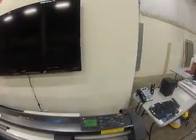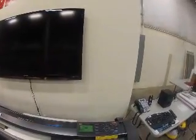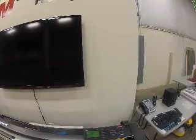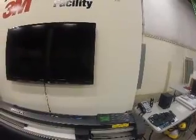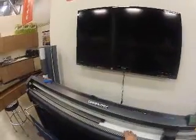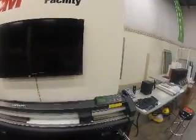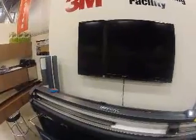I've already got my speed and force set up, but I'm going to run through it so you know how to change and set up your conditions. For speed right now, for 3M Scotchgard, I've got it set on 30, which is fairly fast. I recommend if you're running Venture Shield, you want to be at a speed of around 20, maybe even 15. The reason is 3M actually has a paper carrier that tracks very well because the grit rollers dig into it. With Venture Shield, it has a synthetic liner, which the grit rollers don't dig into as hard — so if you're running it at higher speed it can tend to shift and drift a little more.